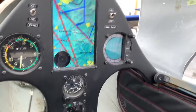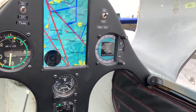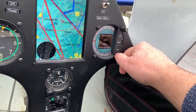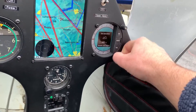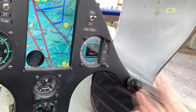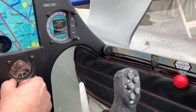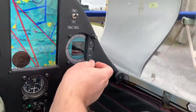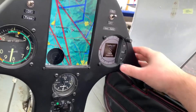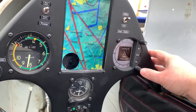The ERA is booting up as well - a nice vario with full electronic capability. It's also got IGC recording on it and will have FLARM display as well. Just setting the altitude QNH - obviously knowing the QNH, we're 500 feet above sea level where our airfield is, so that enables me to get the right pressure setting.